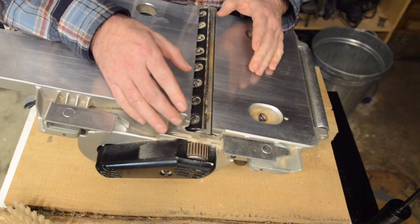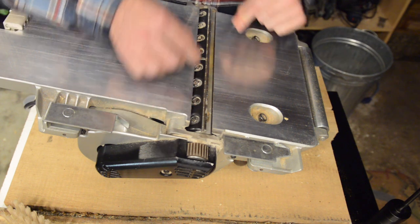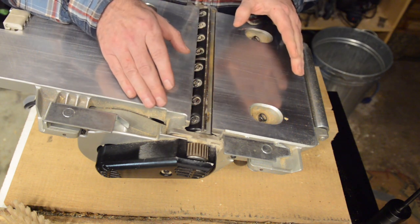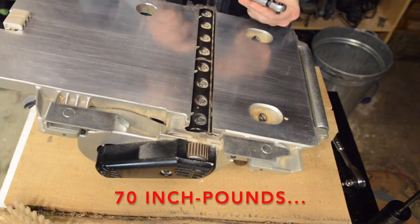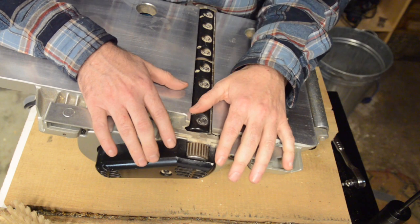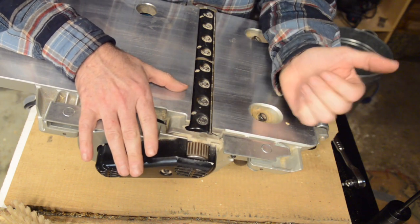What that means is: if the knives are still sharp but you've gotten a little nick in them, you can offset them the opposite way from where you started and often the ridge associated with that little nick will go away. We'll repeat that on the other side.